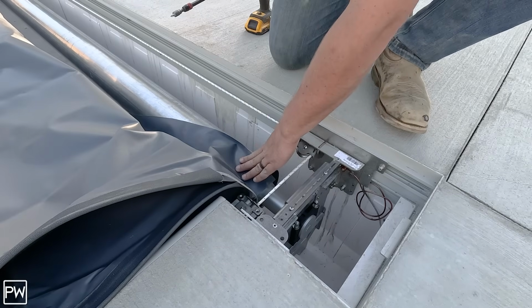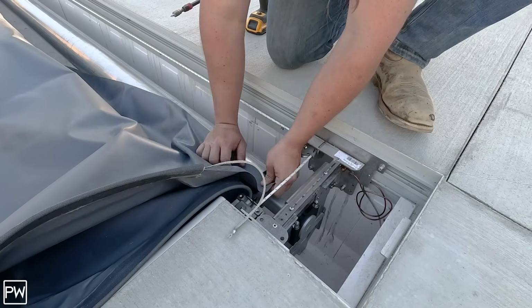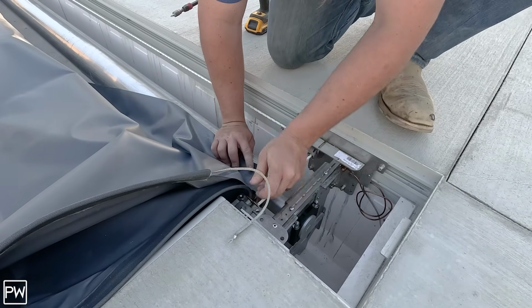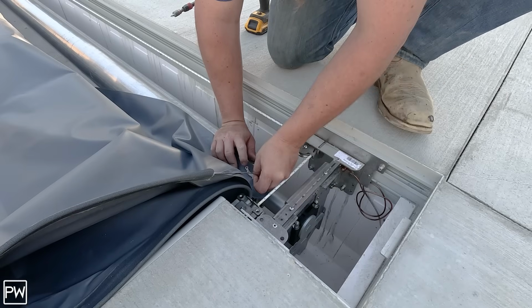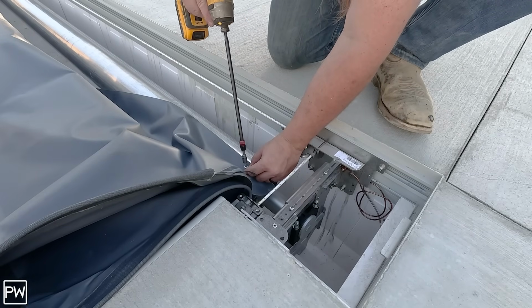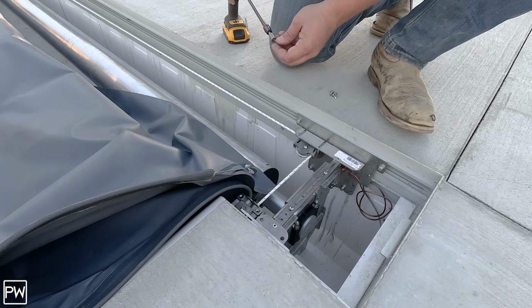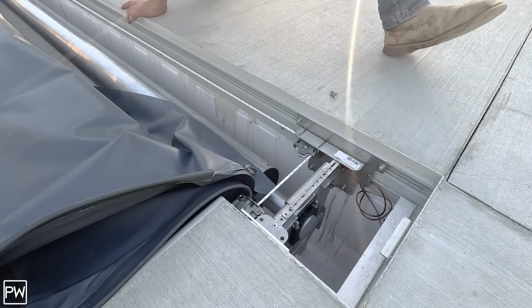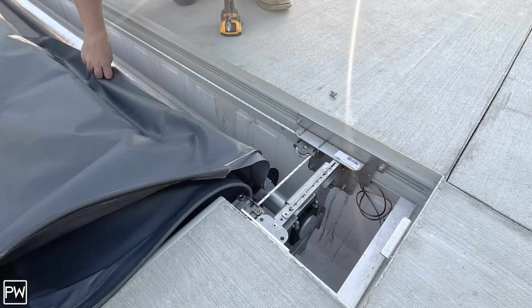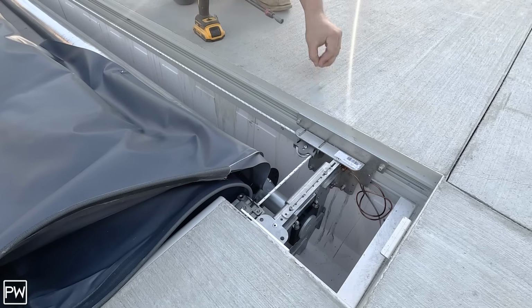We just wanna make sure we keep it a nice line on the top of our tube here. Fabric's in line with where it comes out of the track. Gonna bring my bonding eyelet down, pin this to the tube. Just like that. We're gonna jump over about 2.5 feet, pull our cover nice and tight. We're still in line with that side. Gonna pin. Still got 3 screws left.